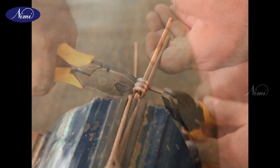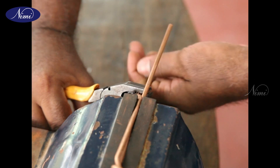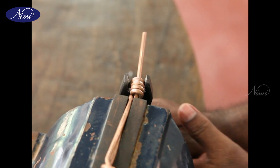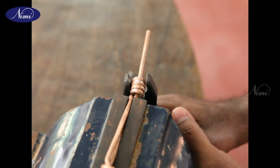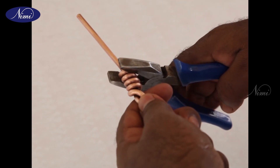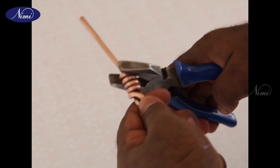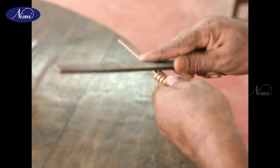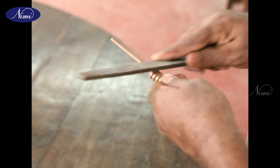Make at least 5 turns. Step 7: Repeat the same procedure at the other end of the conductor, but wrap the conductor in the opposite direction. Step 9: Press the ends with pliers to the conductors. Step 10: Smoothen the ends of the conductors with a flat file to avoid sharp edges.